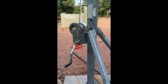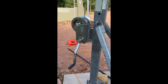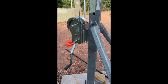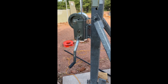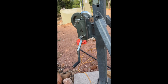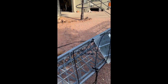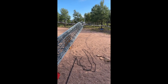As you may have seen in previous videos, this is a 2,500-pound winch — I think it's a Fulton 14-3200, they changed the name. It was a 2550 Fulton and it actually has holes that fit. If you have a crank-over tower and need something that can handle more weight, remember the winch that comes with the tower is designed to tilt the tower over — it's not designed for whatever you put on the end of it, in this case 200 pounds of equipment up there.